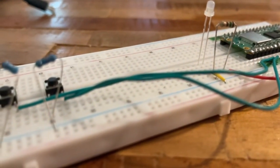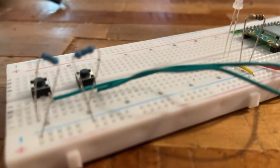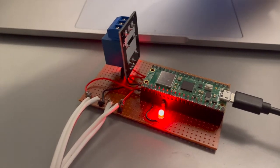Once I have the code fairly done I replace the mock sensors with either real sensors or buttons on the breadboard instead of relays or other output. I usually use LEDs at this stage so that it's easy to follow their state. Only when I'm confident that the hardware and software work together do I take out the trusty old soldering iron. I'm not very good at circuit design or soldering so my boards are not always very efficient or pretty, but so far they're getting the job done. If you have any tips or tricks I would really appreciate if you can write a comment about it.